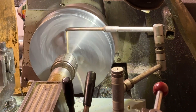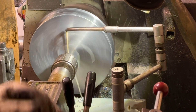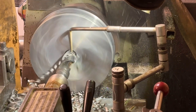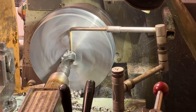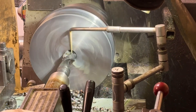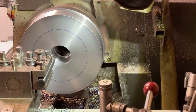If we run it too fast then obviously it's going to vibrate a lot and not going to cut very well. Now I'm putting a 30mm drill through just to get a start on it, so we can then continue afterwards to start boring it out. I've speeded this up quite a bit.